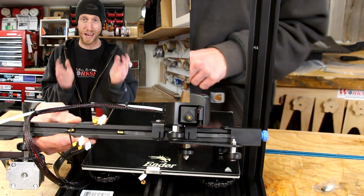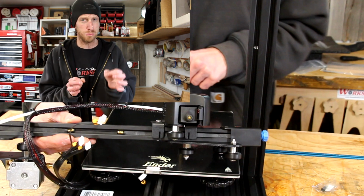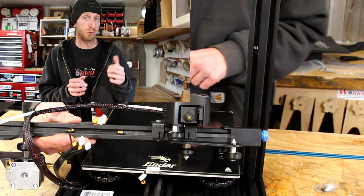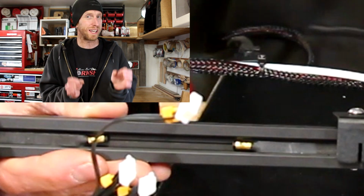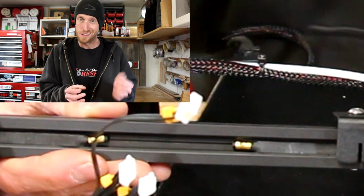Whoa, whoa, whoa. Hang on there, Turbo. I want to stop this right here just to let you guys know those brass ferrules that this guy putting this thing together was just talking about, they're supposed to be connected at this step. It actually says that in the book. It wasn't completely clear, but this guy missed it.